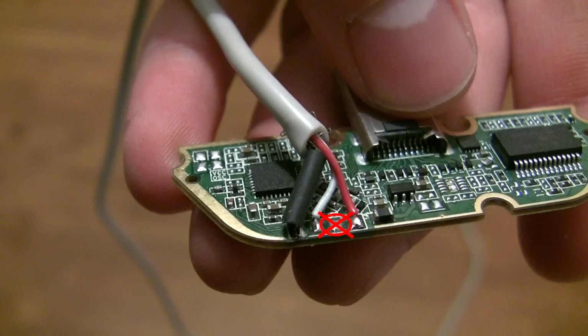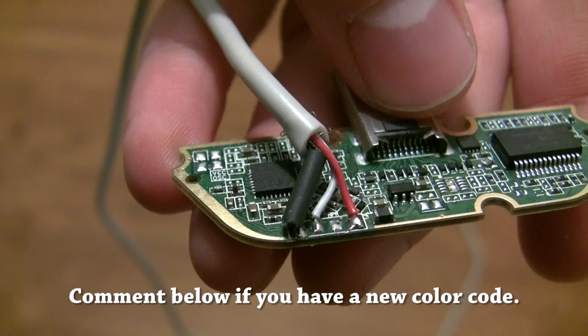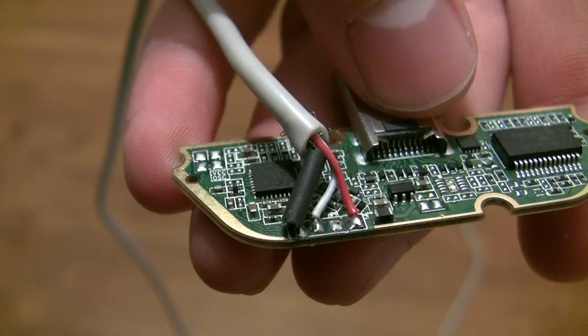Just remember not to connect anything to the pad labeled HPR. If you do modify a headset that isn't in the list, please comment below with what the color code is for your headset so I can add that to the list. Credit to you, of course. Anyway, once you've determined which wire is your mic wire, solder that to the board.